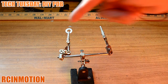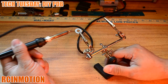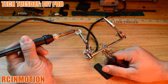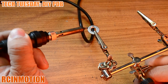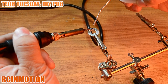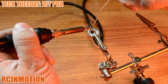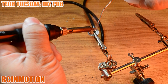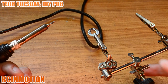So let's go ahead and start heating up this washer. I have to hold the iron here until it gets pretty hot. Now it's pretty hot, so I can go ahead and start putting on some flux solder. Once it gets pretty hot, and because you put a little effort into sanding it down at the beginning, it actually grabs the solder a bit better. That's a clean, nice little soldering job.